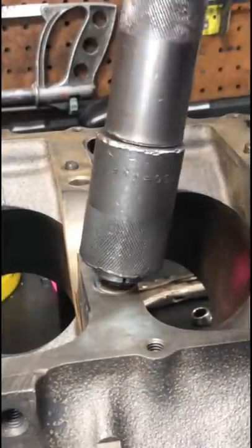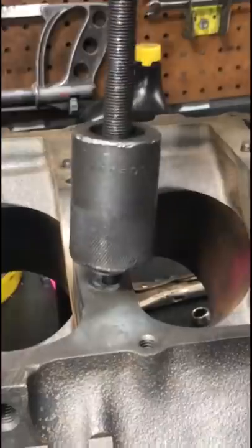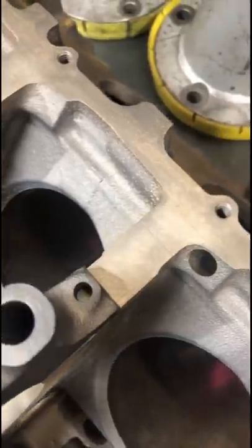So this time I was like, let's take this seriously, and let's just try to build up a little bit of a nub here. I'm just putting little bits of filler on top of that dowel pin right there. And it doesn't look very pretty, but it was just enough that I was able to put the collet back on and get the stud puller on it. And just like that, it pulled right out.